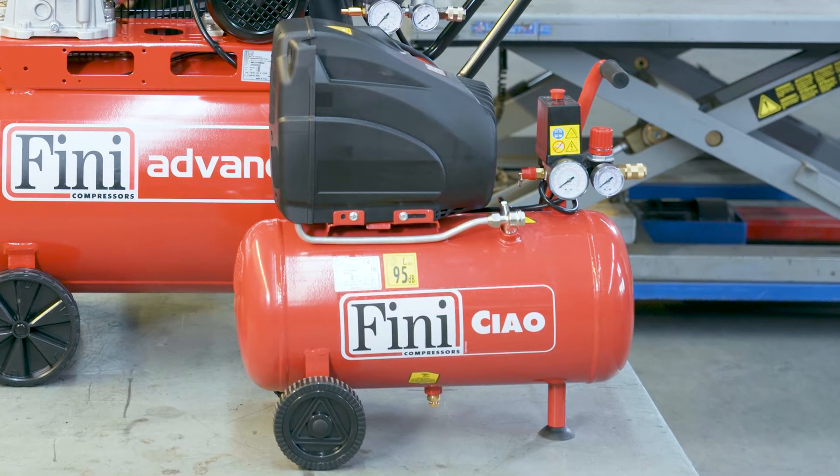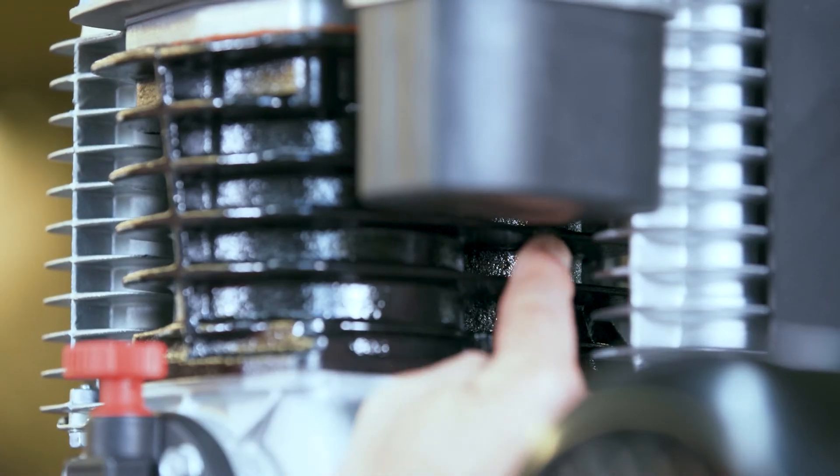In single-stage variants, there's one cylinder and one piston which compresses the air in one single chamber. In a two-stage compressor, you have multiple pistons of different sizes. The first stage has a larger diameter than the second one, and a greater amount of air is compressed at a lower pressure. At the second stage, a smaller amount of air is compressed to achieve a higher pressure. On a two-stage compressor, there's a low-pressure cylinder and there's a high-pressure one. Two and multi-stage piston compressors come with a higher efficiency than single-stage piston compressors.